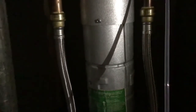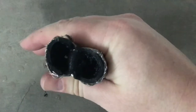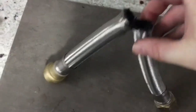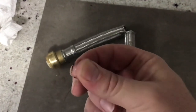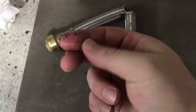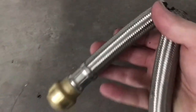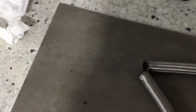That's what you need to fix. You need to pull those off and replace them with new ones. I'm going to pull them off, cut them open, and show you what's on the inside. I've cut this open — if you can see on the inside there, that black rubber, that's what you guys are seeing. That's what you guys are getting in your tub — those little specks. So you replace this tube right here and you will fix your problem of black specks coming out of your hot water tank.